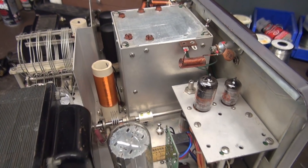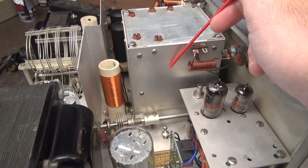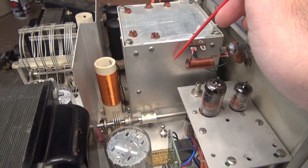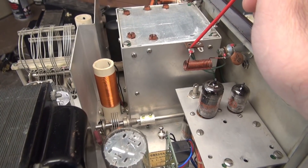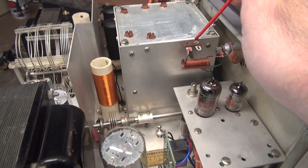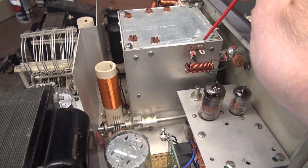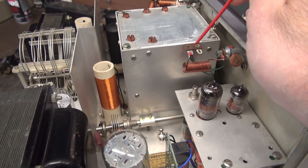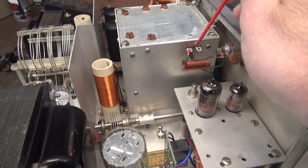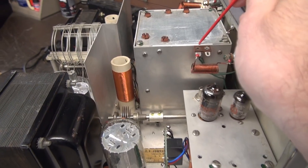The first thing I did after pulling the chassis out of the cabinet was remove the side panel of the VFO to inspect and see if that old 18K carbon resistor feeding the OA2 was there. We call that the Chernobyl resistor because it goes up in a ball of fire over time. It was in there, showed no signs of overheating, and everything in the VFO cage was nice and clean. But I went ahead and changed the resistor, checked the tubes, and everything's A-OK in the VFO compartment.